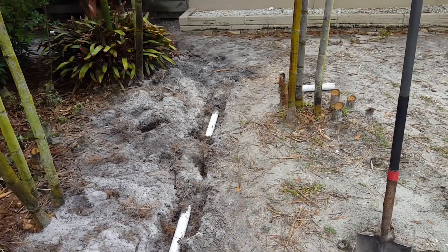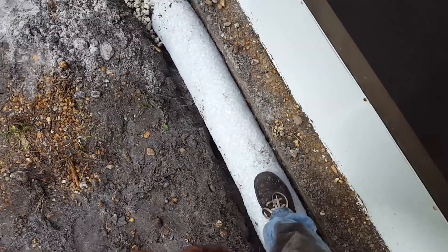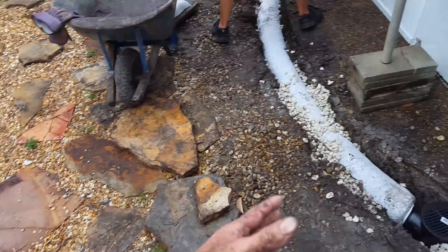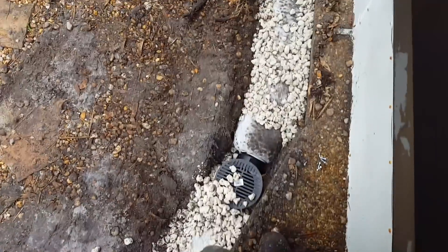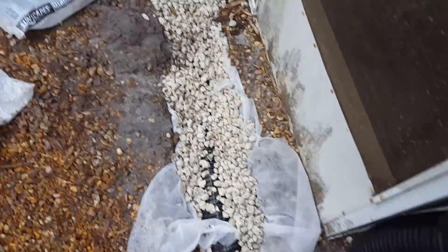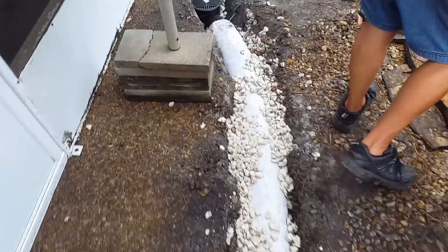Now we're adding the gravel. Gravel is basically just holding down the peanut pipe — you can see how I step on it and it goes down. We just need to get some weight on top and then throw some of the river rock out here to bring it to a finished grade. We've got it all installed, looking really good. A couple of catch basins — we like to use round six-by-six catch basins. We hooked up the downspout, the line begins at the corner, a little more gravel there, comes around looking real good, and we've already covered the discharge.